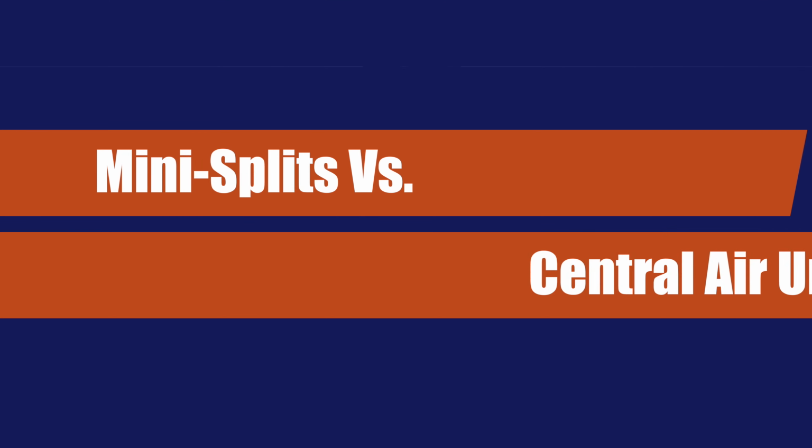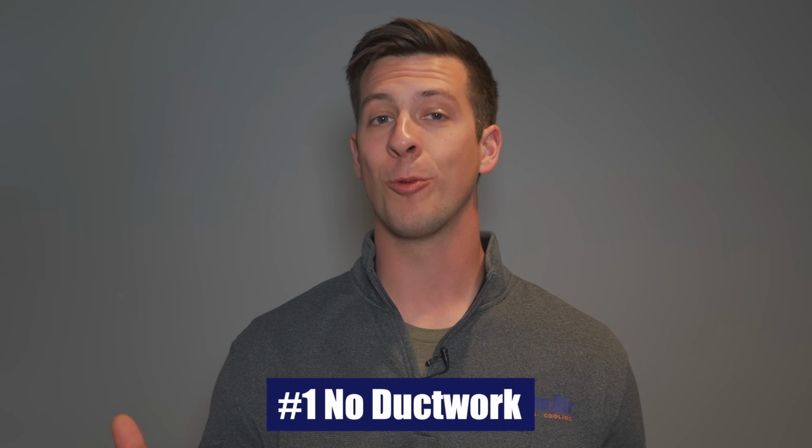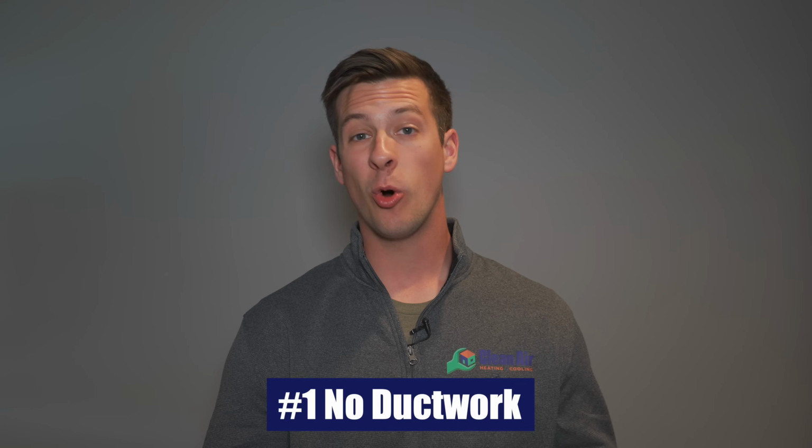So why would you choose a mini split system versus a traditional central air system? There are a lot of reasons to choose a mini split system over a traditional central air system, and here are a few. First off, again, no ductwork. You know, it's in the name. Many older homes don't have ductwork already installed, so it's really difficult to go ahead and add that, and it can be expensive. But also mini splits can be great for rooms like a garage or an outdoor shed where you don't want to have to run new ductwork.